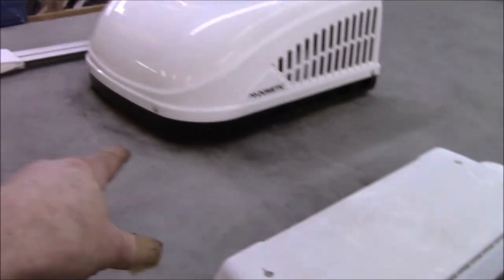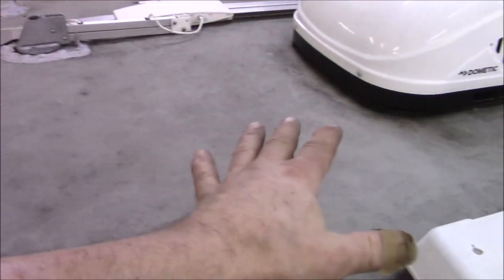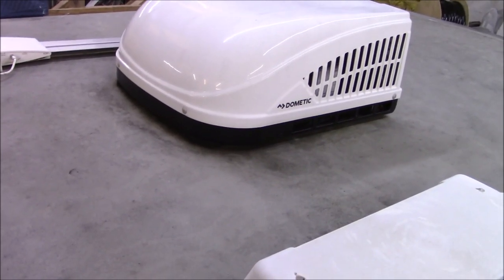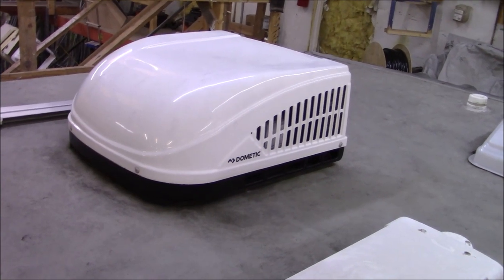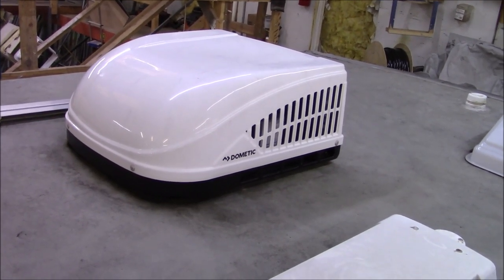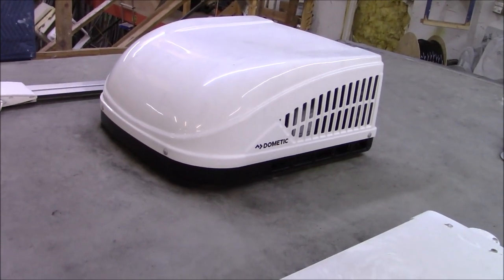It's a shame — you look at it and go, 'Hey, it doesn't look like there's anything wrong with it.' But these protrusions are where you have all your trouble. It still didn't solve the problem of the AC. Underneath that air conditioner is just a foam gasket, so all this water coming down hits that foam gasket. On Flex Armor, I know that particular guy had a video about ACs, and within the one-minute mark he says, 'Well, if it was a commercial roof it would have flashing and counter flashing on there on a curb' — and that's exactly what we do.